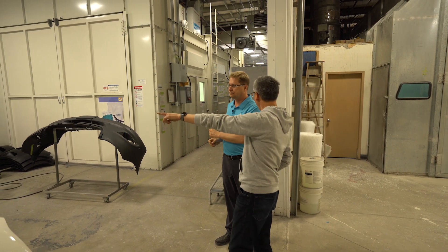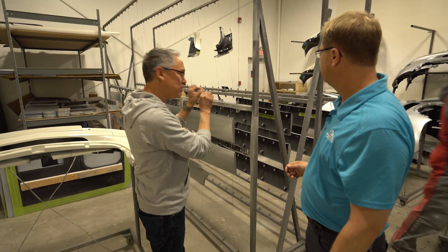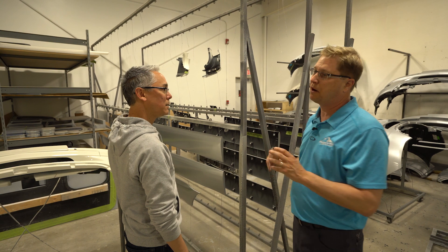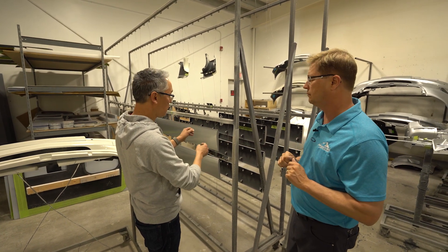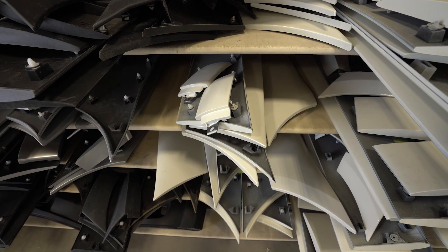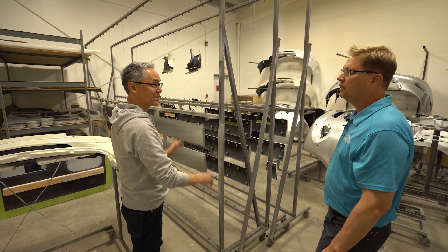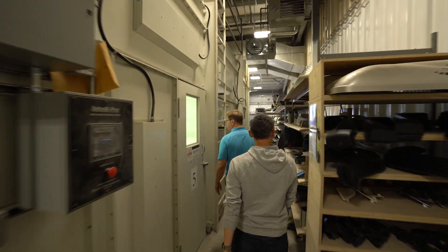So looking here, these are some of the side moldings for the paneling on the van. These have to all individually be removed. Yes — they're all individual, like a Christmas tree tab. Each one you have to pop off painstakingly and then put them all back on precisely. That sounds time-consuming. It is time-consuming, and when they break, that's about a $4 clip. So there's a lot of process that goes into getting this done. This is important to PleasureWay — you get a full coating of the paint, it looks right, and you're not going to see behind it. This edge here is going to be painted. If it was painted on the van, this would usually end up black because you can't get in there. If moisture gets in underneath that paint, it's all going to flake off. All these parts we're seeing here were removed from the stock chassis from the manufacturer, and they'll all go back on that identical chassis, which is labeled right there — that's the serial number it's going to go onto.